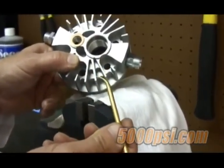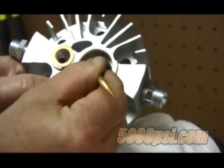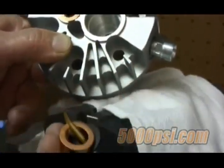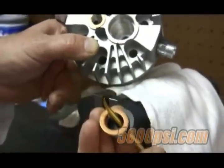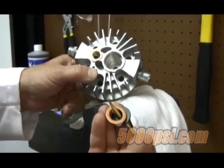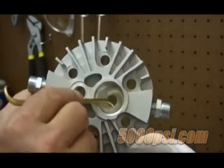This tool is available from New Parts. Remove the seat and the gasket. Sometimes these parts can be resurfaced and reused, but this is not cost effective and it's more prudent to replace them with fresh parts. Next, inspect the bottom surface of the valve cavity.